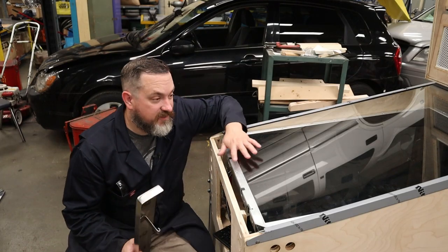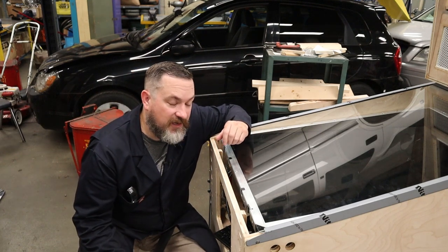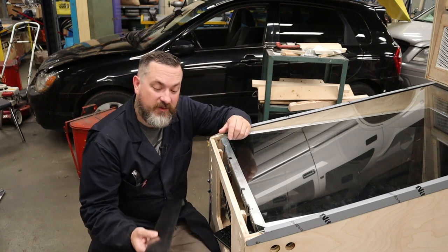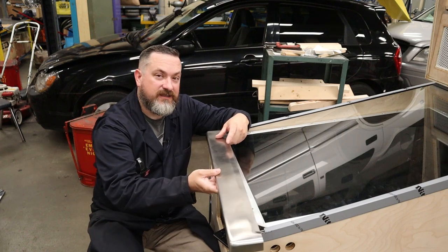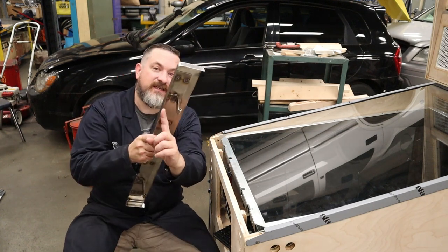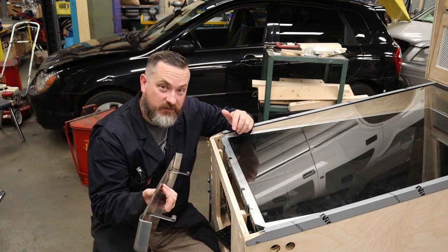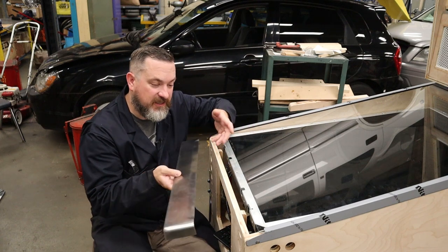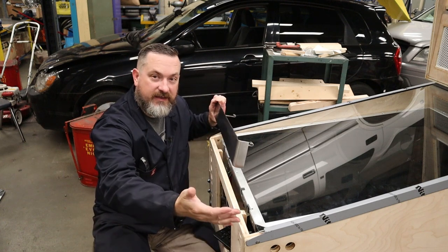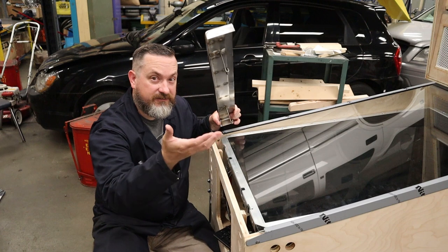All right, in most cases, you slide the playfield glass and put your lockdown bar in for a test fit and you are all done. However, in my case, I had a little bit of a design flaw. If you may or may not remember when I did the lockdown video, the lockdown bar wanted to slide to the front, and so I had to put these little wooden blocks in here to sit against the side of the J-hook to prevent that from happening. What I had to do before, and I didn't really think about this too much, is lift the monitor up a bit so that I could get the edges of the lockdown bar away from the cabinet and then slide the J-hook past the edge of the wood block to get it to lift up.